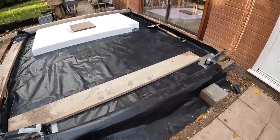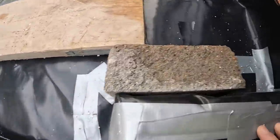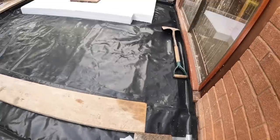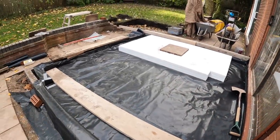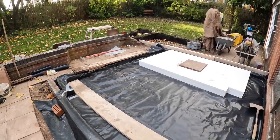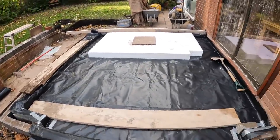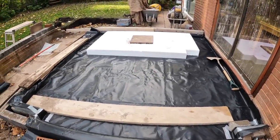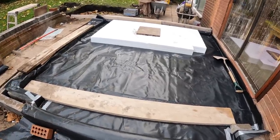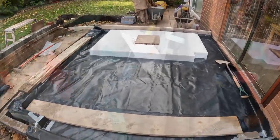Took plenty of pictures for building control in case they can't come and see it. And always taping into the corners, so you've got concrete right into your corners. So hopefully it don't rain overnight, but who knows. So that's how to prepare a slab for concrete. A 4-inch ground bearing slab, so it's not reinforced, it just sits on the ground, wackered underneath. So yeah, we'll see you later in this video.